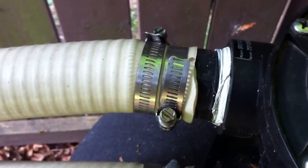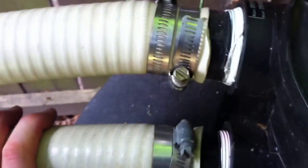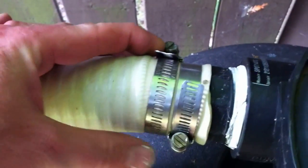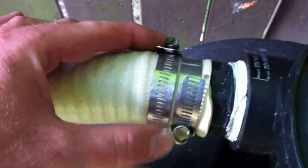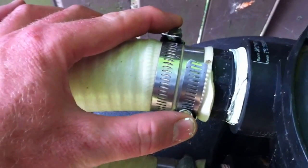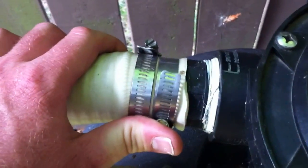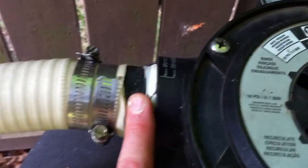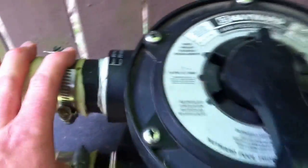Coming out of the pump into the filter, we see the flexible PVC that's been clamped into place. This flexible PVC is for primer and glue connections, not for clamping. Does it work? Well, the water's not currently squirting out, but it doesn't make it correct. At least the clamp orientation is correct — one clamp facing each direction, opposite to each other, because each clamp has a tight spot and a subsequent spot that's not quite as tight. By doing this you get the best of both worlds, tight on both sides. But this should be done for poly and barbed fittings, not for SpaFlex. I'd prefer to see this replaced with a PVC threaded male adapter and glue the pipe into that.